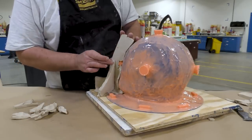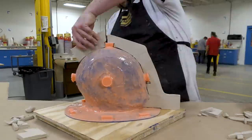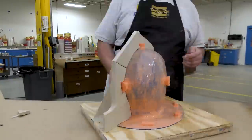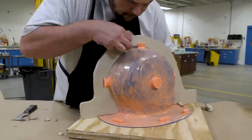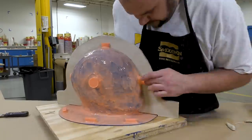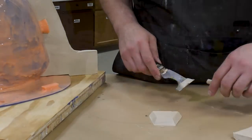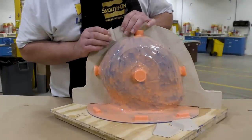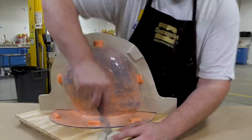To separate the two halves and build up our support shell, we're going to use Sculpey soft clay to do the separation wall. This material is really easy to work with — you can maneuver it easily to create very clean surfaces. All the gaps between the silicone mold and the clay build-up should be closed and clean. We're also going to make some keys using the same clay and press them right against the wall, trimming and cleaning around them so they're tight with no gaps.